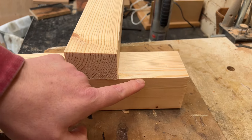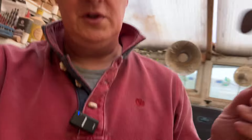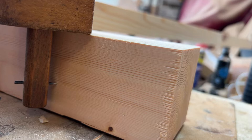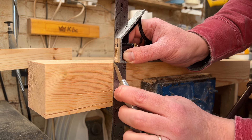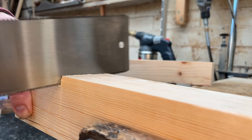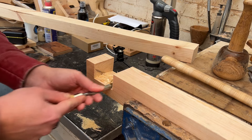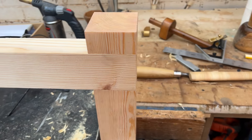To mark off the depth of the cut, you could hold the rail up, but that's a bit long and cumbersome. This is where a marking gauge comes in — a super useful tool, brilliant for just setting the depth you want and transferring it across onto the post. With the depth marked off, come down the sides to match those up. Cut down in between those grooves, then do any fine fettling with a chisel to make it a snug fit and get rid of the rough marks from the saw, and you end up quite quickly with a very pleasant flush joint.